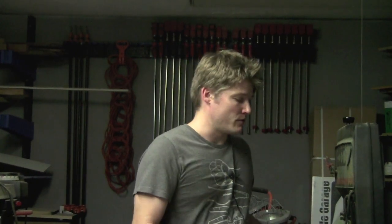And the reason I did not go to like Home Depot or Lowe's to get the epoxy is simply because there's too much water in those products, and it evaporates and leaves a very thin layer, and eventually will start peeling off the floor. I know because my parents had the same problem happen to them. This product is very thick when it dries. It looks beautiful. I haven't had a problem with it since I put it on.